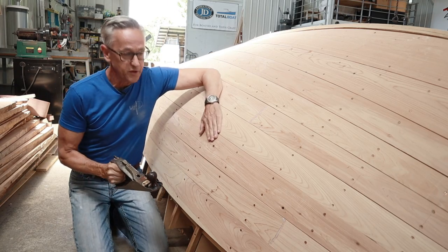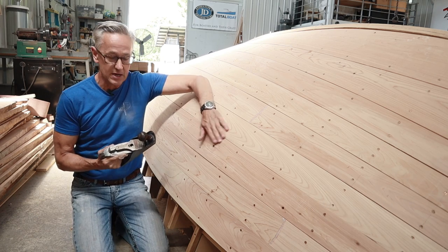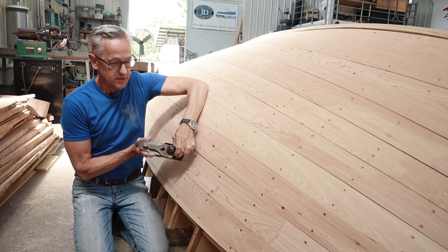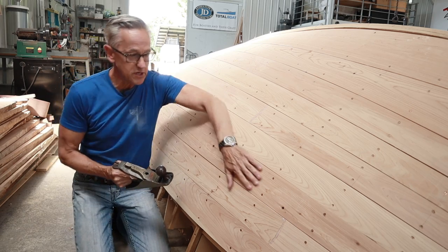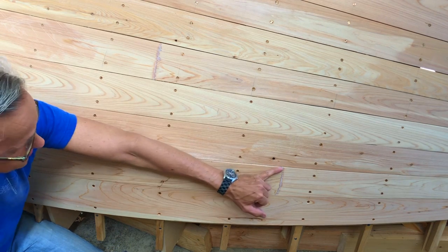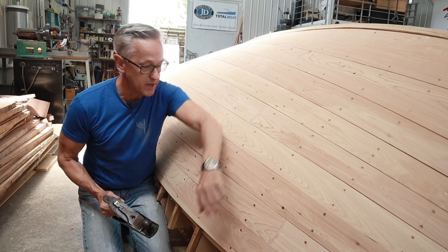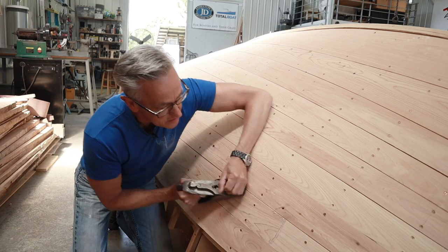One of the first steps to fairing is to start with planing off some of the high spots. And I'm using a number 4 Stanley here. And the trick here is to not necessarily go with the grain, but to cut on a slight diagonal. Now you can see in this board here the light shadow on there. That protrudes probably at least, I'd say, a little more than an eighth of an inch. So what we would do then is to go along here